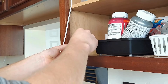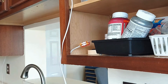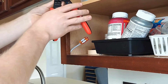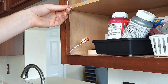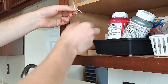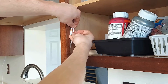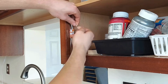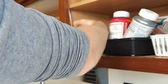Lift up the clips, insert the wires, and then snap them back down. Hold the Wago in place, pull the other wires to halfway down the Wago, and then cut them at that point. Repeat the stripping procedure. Clip the wires into the opposite sides of the Wagos. Be sure you place the positive wires in the same connector and then the negative ones in the other. The positive wire is marked with a red strip while the negative is plain white. Remove the backing paper and stick the Wagos in place.